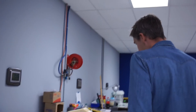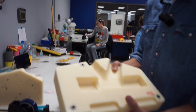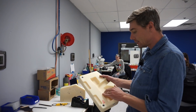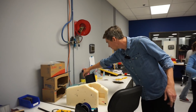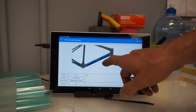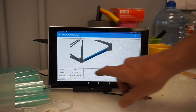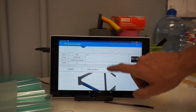We've got examples of all the different preforming tools. This here is a head tube preforming tool for a 49 — this is the exact geometry of the finished part. You can see they're going to actually lay plies into these parts based off of a ply manual. Those ply manuals live on these tablets. These describe the ply location, the ply number, the material, the orientation, and they just basically scroll through by operation number and follow the recipe.